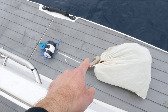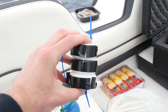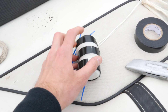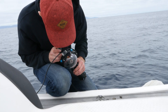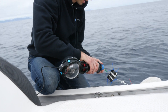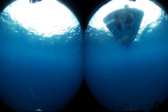I've strapped one of the squids to the outside and put one in the weight bag as well. This time I have attached three salt releases and I've got some electrical tape around them to hopefully slow down the dissolving process. I've also cut the electrical tape so that it doesn't hold it up once the salt is dissolved. Okay, that's recording — thankfully no issues with it this time. The weight release is on, and off it goes.